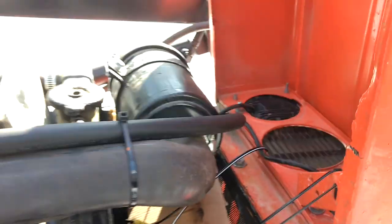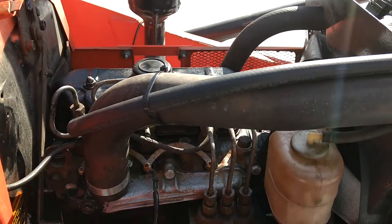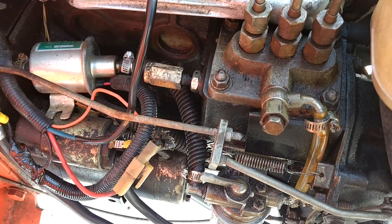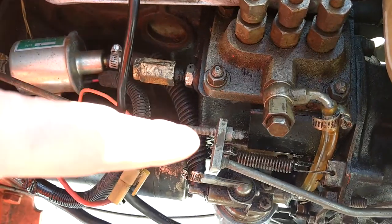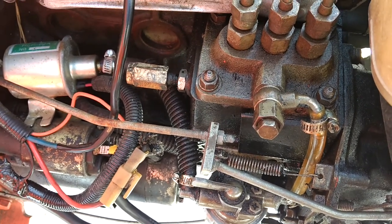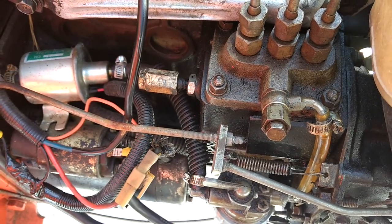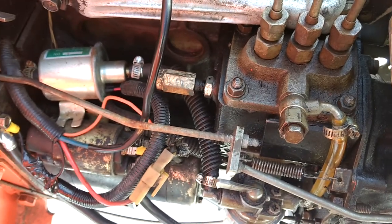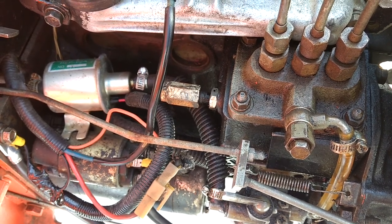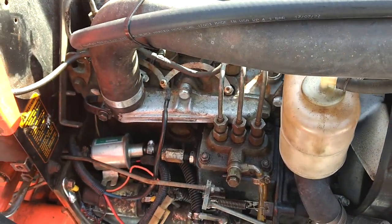I had some cardboard in there just to check — those were two of the big issues I solved. The other big thing is I broke what's called the unload device, right there on the side of the fuel pump, and I bent the pin. I got the pump overhauled — this device won't break if you take the pump out, but when you put it back in I bent the pin. So I got a used one from Western Kentucky Tractor, which is a good source. But it needs to be adjusted for this tractor with a PTO dynamometer, which not a lot of people have around anymore.